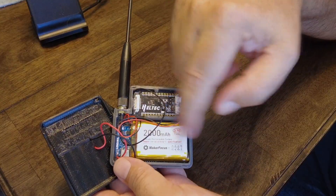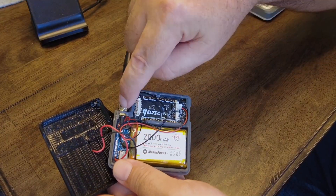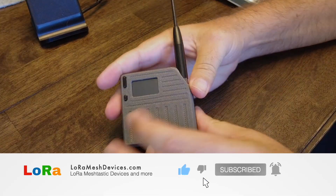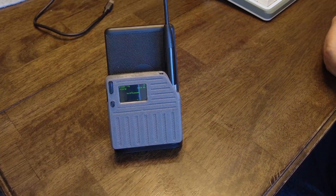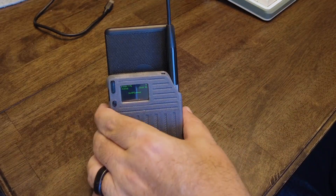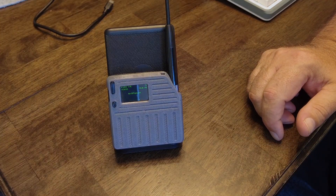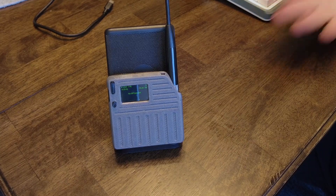You can turn this off and independently just charge the battery while it's in the sun. So that's how simple it is — it all just clips together. You've got an SMA connector with antenna on top, the battery, a little controller, and a little solar panel at the back. It all just clips together and creates a little mobile node with buttons. I had to reprint these buttons because my printer sucks at buttons, but in any case it all worked out. It doesn't have GPS, but this thing really uses so little power it's been running for a few days already.